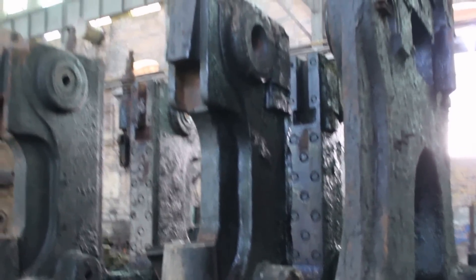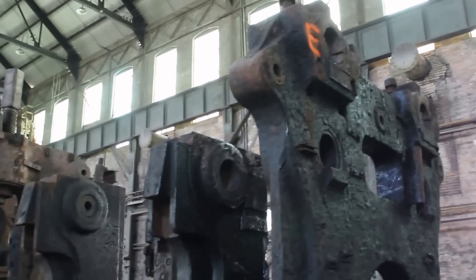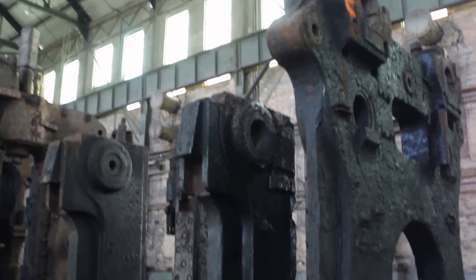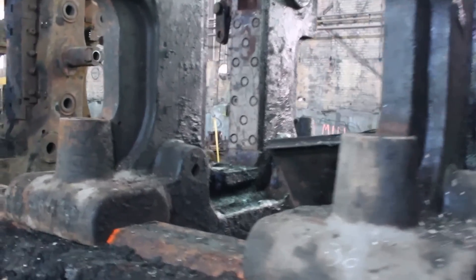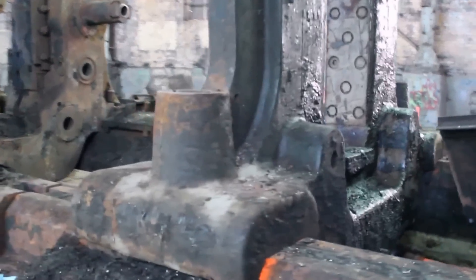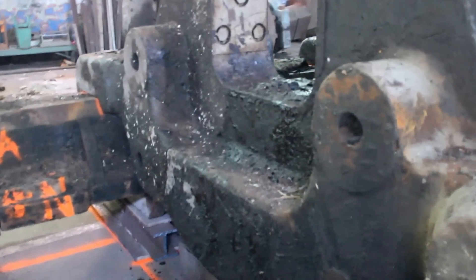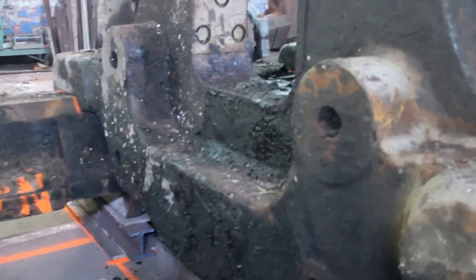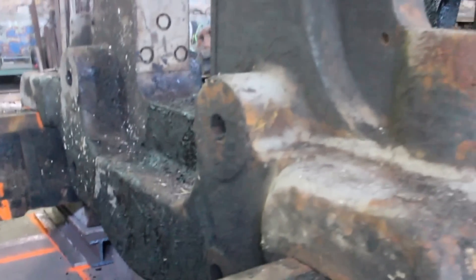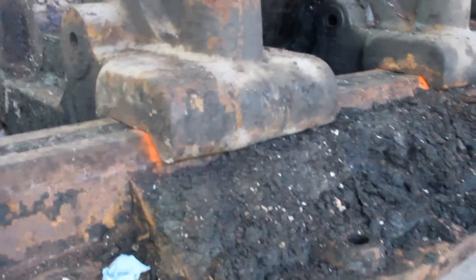Because this is a universal mill, you'd also have two additional drive shafts that come off to run the vertical rolls — those would be up above, and the bearings for that are not on yet. This casting here was fractured, but we got it together pretty good. It was fractured when it was in service, so I don't know how long it ran like that, but quite a while.